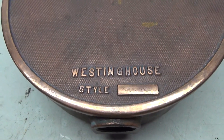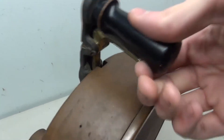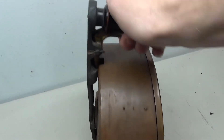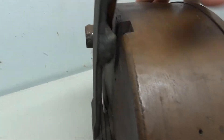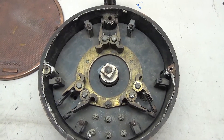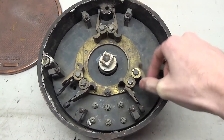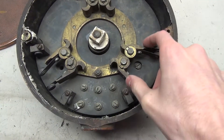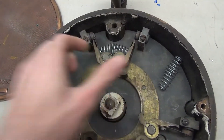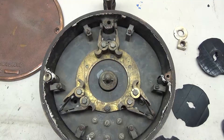The final piece in this project is this Westinghouse car switch, and this one is going to require the most work. The first issue is the locking mechanism — pressing in on the lever actually locks the handle from moving instead of unlocking it, so I'm going to have to design something to fix this. The second issue is the contact arrangement: a critical piece is missing in the center of the car switch that allows the contacts to close when the handle is rotated. At the moment, rotating the handle does absolutely nothing. I bought some springs that fit between the contacts and push them closed.